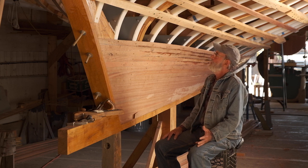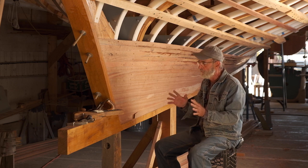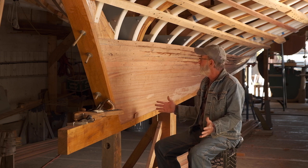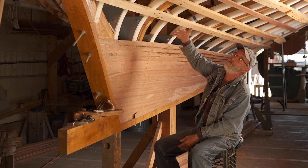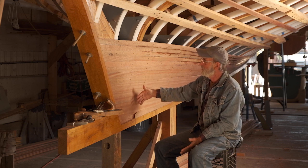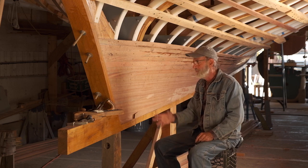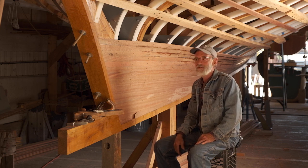We're going to show you a number of different things about the framing and all these things. There are quite a few videos still to go and then we're obviously going to be doing some live video work. The other thing is I actually planed this out right here before the whole boat was planked. I kind of like doing that because it doesn't leave me a tremendous amount of work when it's done. We plank it up a little bit, then I'll take a plane and smooth this stuff out. It's kind of a reward to see it come out looking like this.